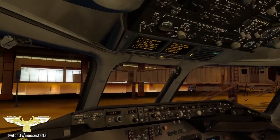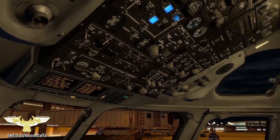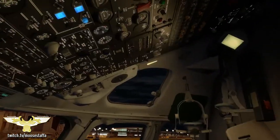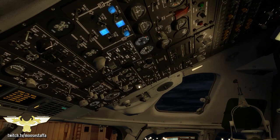Then when you're securing the aircraft, this is after the passengers are off, the leaving the airplane checklist is emergency lights, APU, and the battery switch. So basically you would go through and flip all the switches that you turned on. So basically you just go in reverse order. We've got air supplied by the external now, and we can switch over to that. So we can switch to external power.